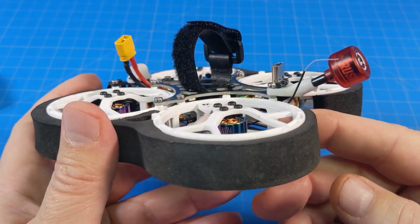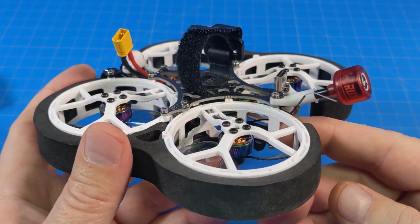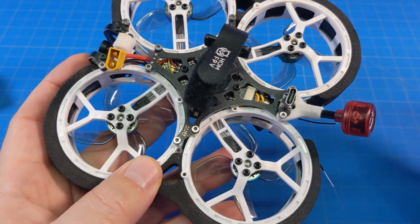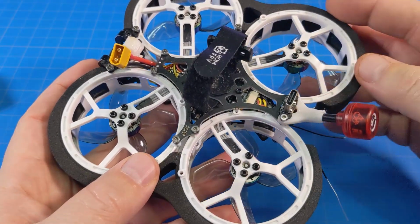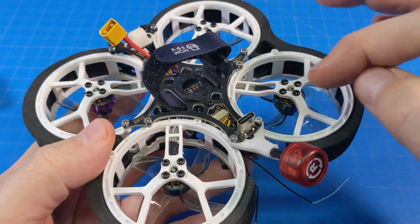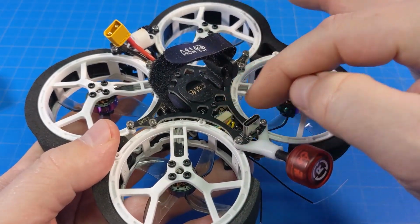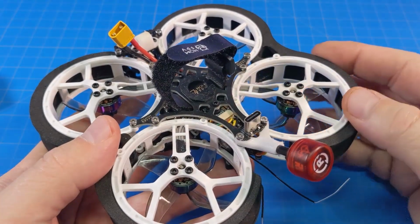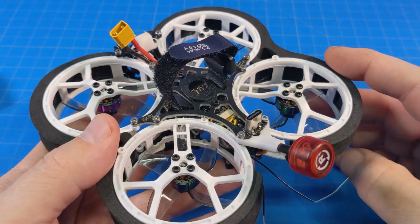That's some sort of PCB, so they have traces in there. So if those lights stop functioning, then you know you've got to replace it. Well, I guess if you've got the skill set, you can replace the individual light that's broken. But if you have a hard upside down crash, you may break a trace that's in this board. So you may have one or more lights that don't work from the trace being broken if you do have a big upside down crash.